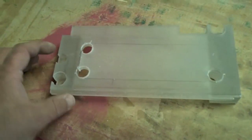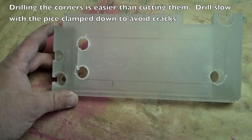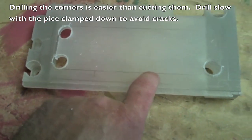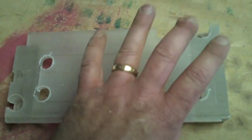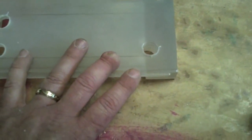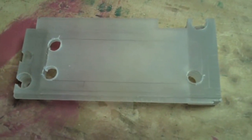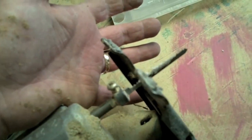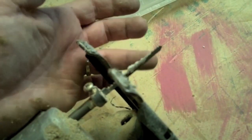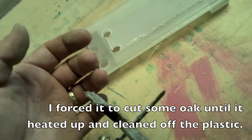When cutting out the actual face plate opening you don't have a lot of room for error, so it's better to have it just a touch small and file it larger — there really is no making it smaller again. Stay on the inside of your lines. Where you have a trim template and where it doubles and triples up, understand it's going to cut a lot slower — take your time and keep the heat down on both the blade and the plastic. That might mean slowing down the jigsaw or squirting it with a little mist. Don't rush it because the penalty is starting over. That melted plastic stuck to the blade means you were going too fast, and once it starts building up it attracts more plastic, builds more heat, and your problems just get worse and worse.